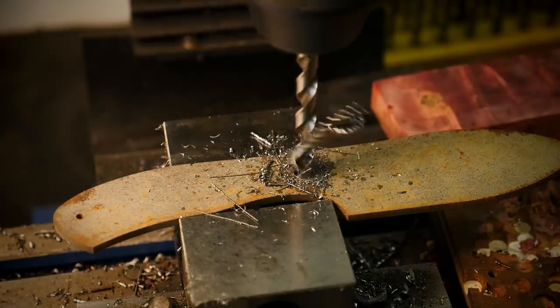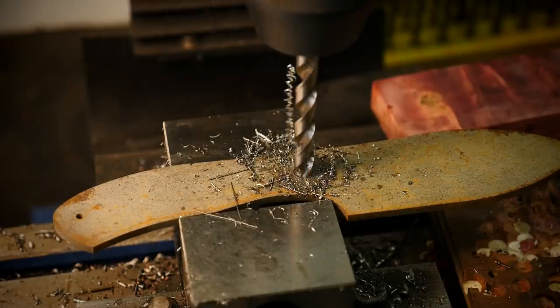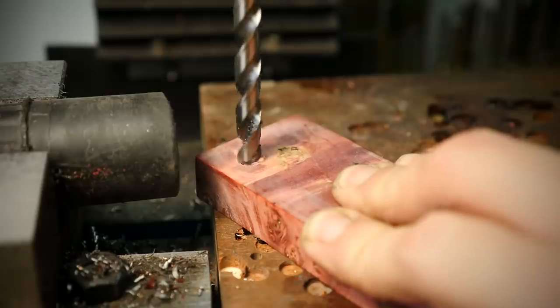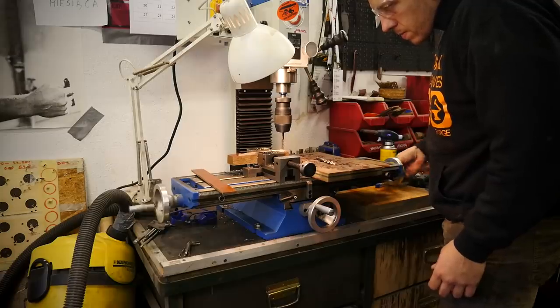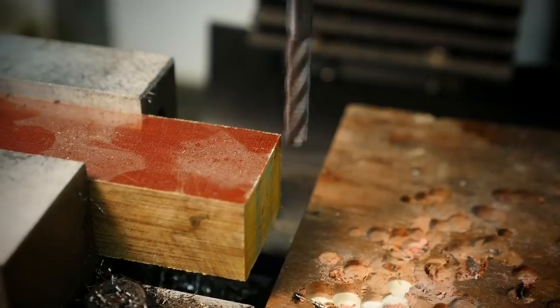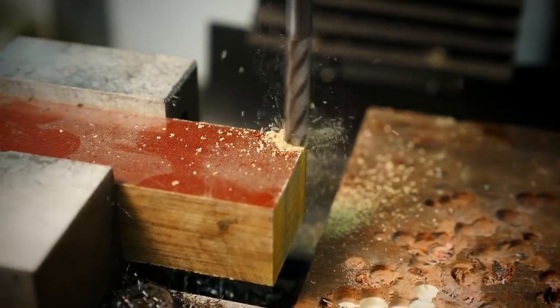Number 4 is the drilling and milling machine. All holes drilled in your workshop should be perpendicular to the surface of a knife blank — this is something you can't do with a hand drill. And you probably don't want to mess up a nice piece of ironwood or some fancy stabilized wood. Milling is also a very useful function, especially when doing a hidden tang knife or to combine two materials on one scale, like on the picture.